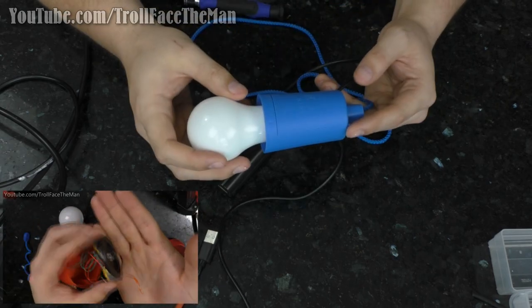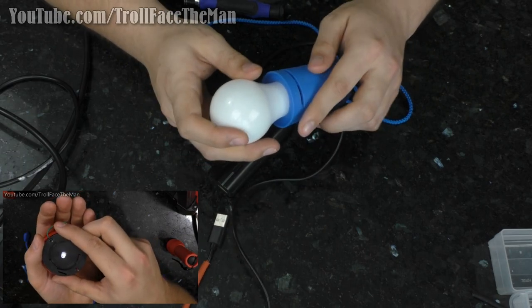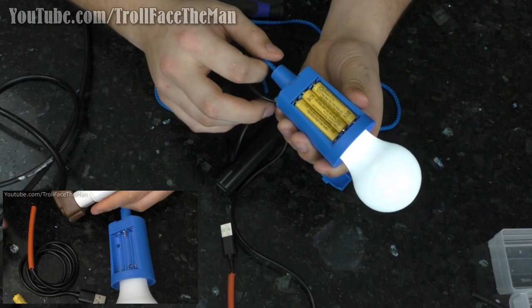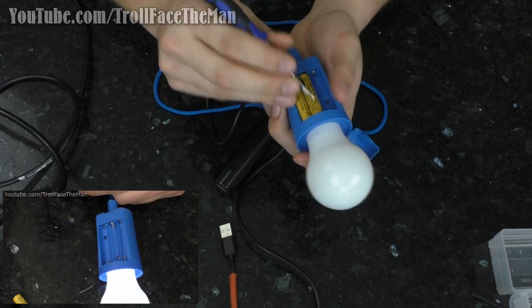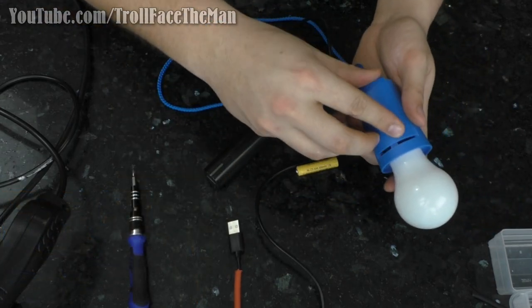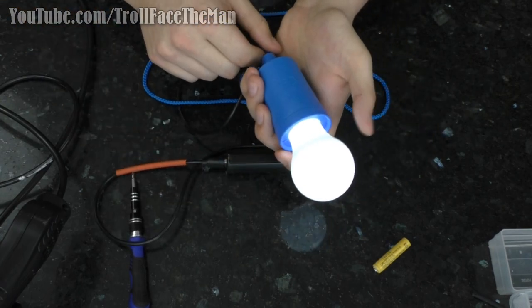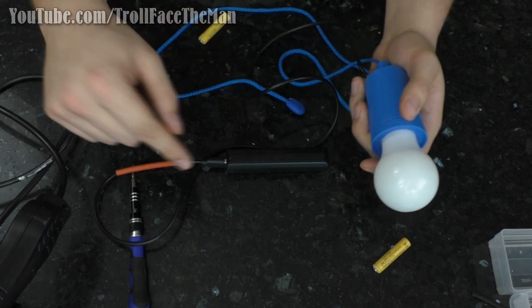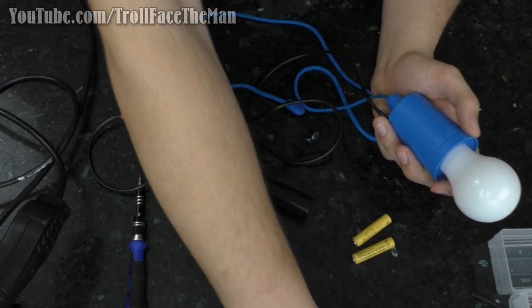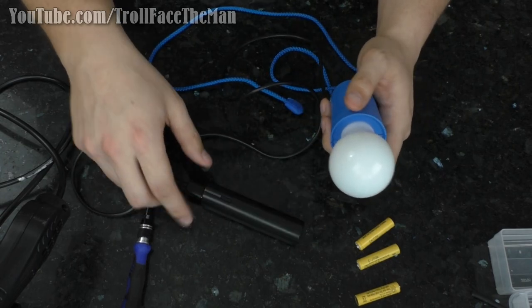The first one, looking at the bulb itself with the comparison between rechargeable and alkaline batteries, which I will link below, is video one. A secondary video where I modified this bulb to work off of either AAA batteries, like it has in there, or for longer term use, it can also work off of any USB power source too. But the issue is that you can't have the batteries and the USB plugged in at the same time because the batteries will either try and power the USB port, which is no good, or the USB will try and charge the batteries, which is also no good.